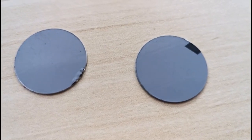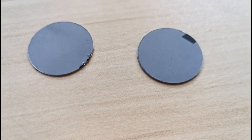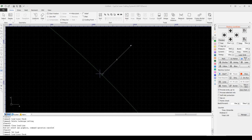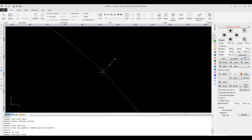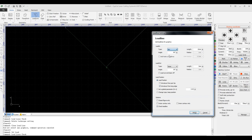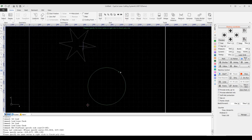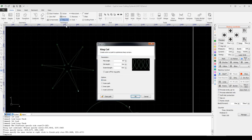In the last two tests, we only changed the type of lead line — so why did it make such a difference? When using a straight line lead, when it reaches the sharp corner, the system automatically runs the sharp-angle cutting process: it stops the laser and blows gas at that point, then cuts. That is why the surface film gets blown up and a little slag appears. But when using an arc lead, there are no sharp corners — it aligns directly with no stopping and blowing process. This principle is the same as using the ring-cut function to cut shapes like pentagrams.